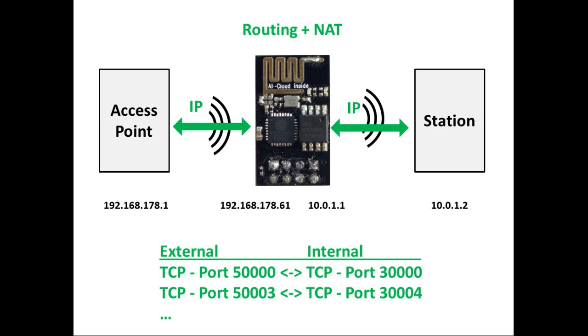This means that the ESP in the middle — the NAT router — is more or less a proxy that translates IP addresses and port numbers from one side to the other, so that the whole network behind the ESP where the station is appears to be one single station of the ESP to the outside network. This means the internal network is completely transparent to the rest of the world. We all know this idea from common home routers that work exactly the same way.